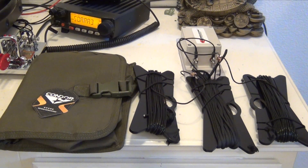According to the owner's manual, the SWR is typically 1.3 to 1.6 when the antenna is at a height of about 35 to 45 feet. That being said, we all know there are other things that can affect the SWR, such as your elevation, the balun height, structures, the angles of the wires, as well as your feed line length.